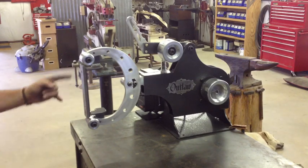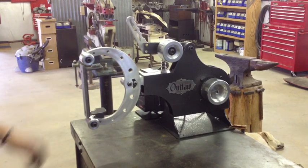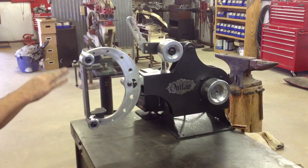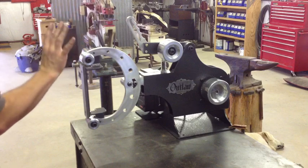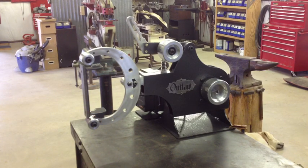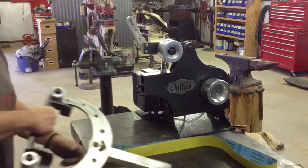The back comes off really quick with two bolts right here if you want to change the backing when it gets some wear, or if you want to add ceramic glass or something like that. There's a little front-to-back adjustment so you can make that work as well. The back will also come off if you wanted to throw a J-flex belt on there to do some slack grinding, deburring around edges, or similar work. There's also an adjustment here to tilt it up or down for whatever is more comfortable, and that's been a pretty handy attachment here in the shop.